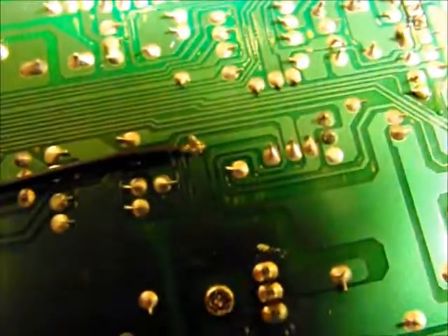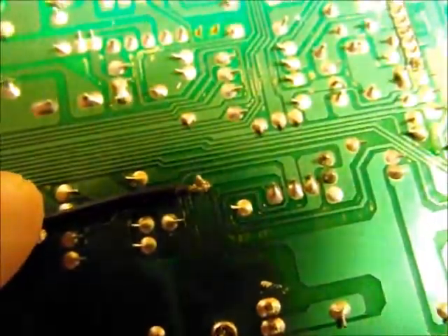These links are going to be factory done. The soldering on it's pretty piss-poor — it's a shit soldered joint, done in the factory. This UPS has never been repaired, so it's a fairly poor soldered joint. There's a couple more bad soldered joints over there too. The overall quality of construction is pretty average — not bad, I've seen worse. The first step would be to photograph the layout of everything, then unsolder all the damaged components, and of course use bicarb soda to scrub the board so it's got no acid on it.